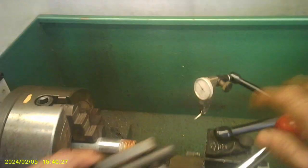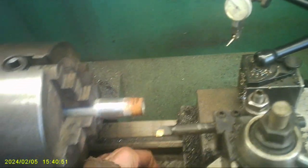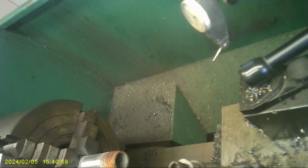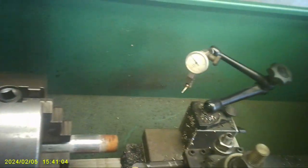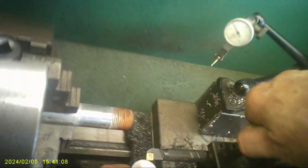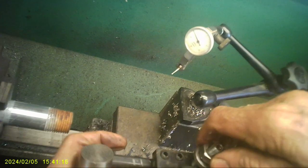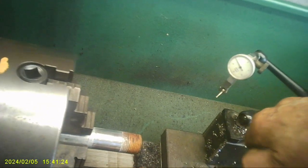What I got for that is this boring bar — that should fit inside there. Now this drill. Let's get this thing in there. I made a spacer out of stainless steel to tell me if I'm on the center line. I think this needs to go up a little bit. I want the tip of that tool to be right even with that.